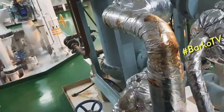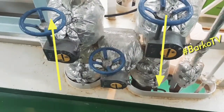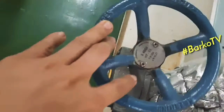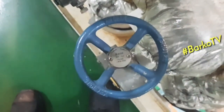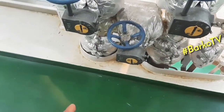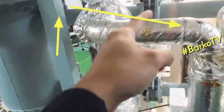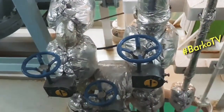Below it has three valves coming from the inlet. The right side is the outlet and the left is the jacket water inlet. The center is the bypass — it means if you don't want to use the fresh water generator, just close the in and out and open the bypass. Right now the bypass is closed and the in and out is open. That is the source for our heating, with a loop going to our main engine cooling.